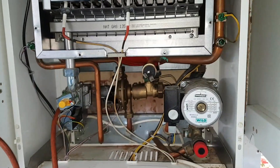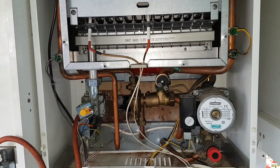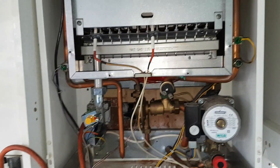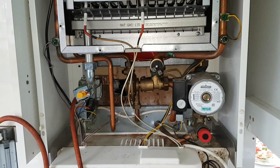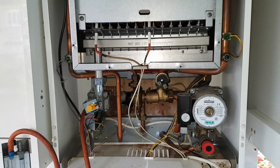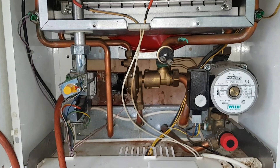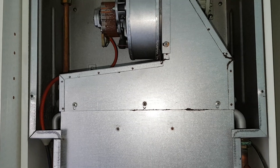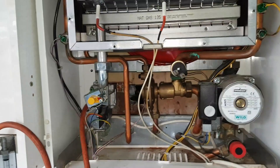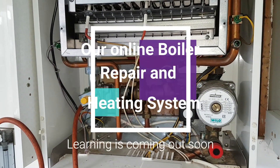So that's really the basics of this boiler and how it flows around to the radiators. One more point: this is a standard efficiency boiler and it doesn't have a plate heat exchanger. You'll see lots of boilers with a plate heat exchanger, but this one doesn't. There are a few boilers like this design — some have a diverter valve but no plate heat exchanger, and some have no diverter valve and no plate heat exchanger. So this main heat exchanger does both jobs: it does heating and then hot water. Just get familiarized with how boilers work and the operation, then you can understand the differences.